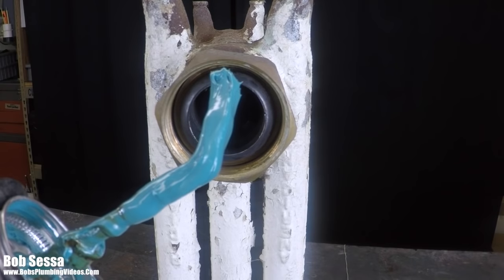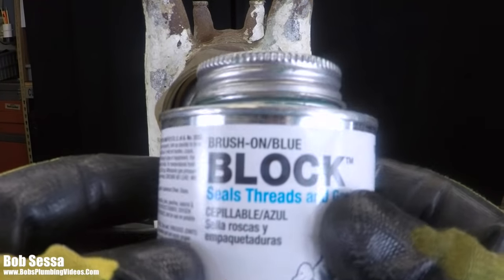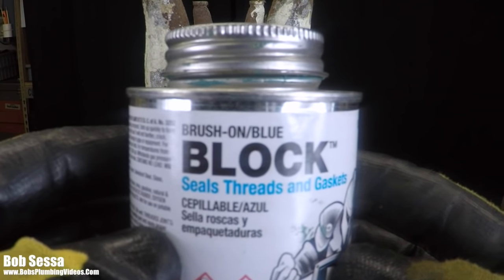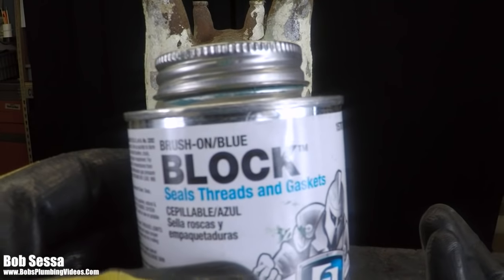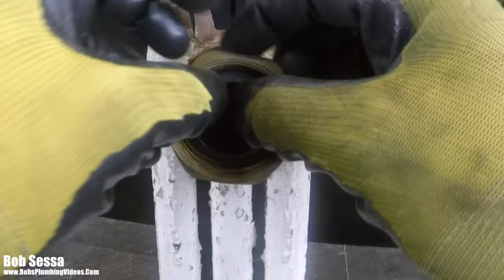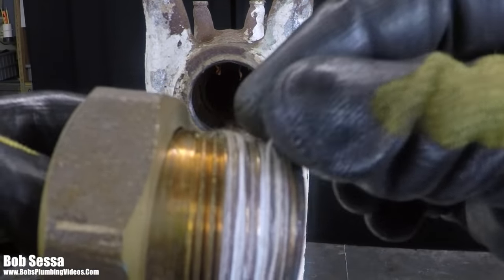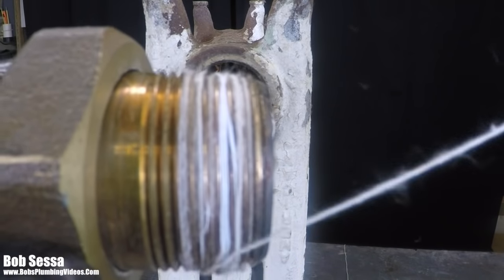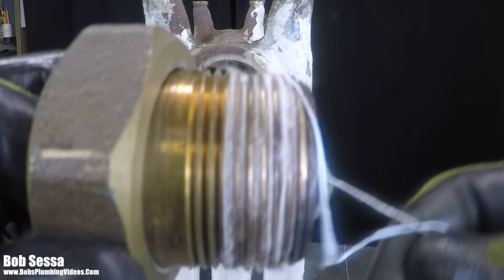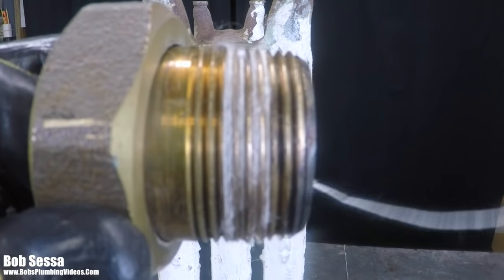And whenever I make an excessive cut, and it looks like it's going to be a questionable joint that I don't think is going to really hold, that's what I do. So I still to this day carry my spool of lampwick. And again, lampwick is simply a cotton-based thread, if you will, that you put in between the threads. And that's what I do when I cut too far into a fitting.